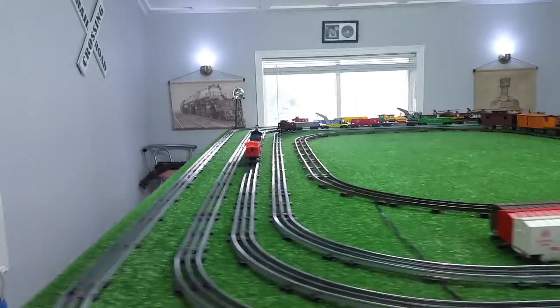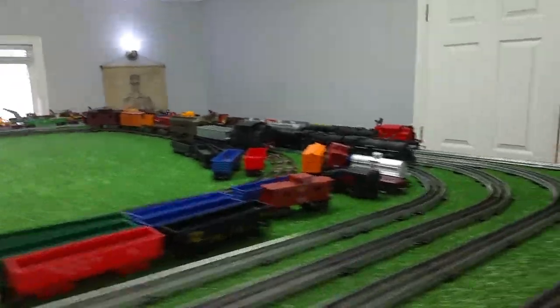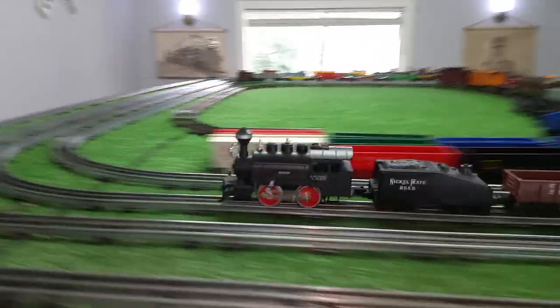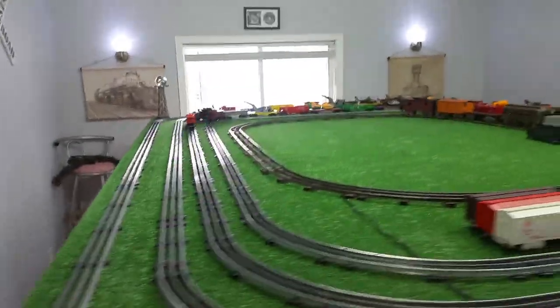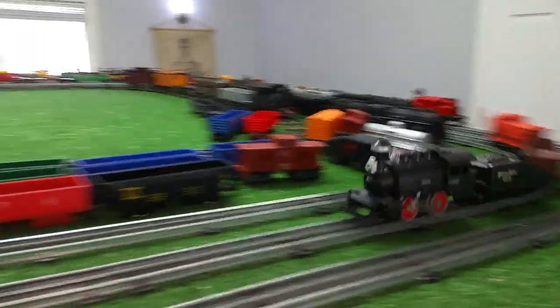As you see, just adding a simple diode to the transformer itself, you can run a DC locomotive on AC — it's really simple. I'll just pull this apart and solder a diode directly onto the motor, and from then on this will run on AC track power. It's a really cute little locomotive.